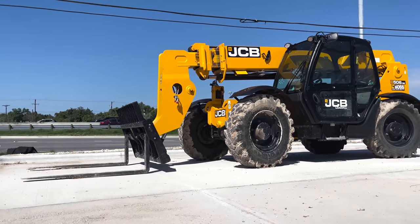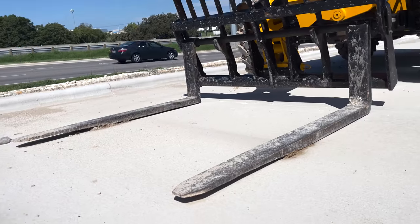Next I grabbed a telehandler — people just call it a forklift. I used a 5,000-pound rated strap wrapped around the assembled poles, slid my fork through the strap, lifted them high up in the air, and carried them over to set them down. I went a few inches above the pole base before actually setting it down because I had two guys on the ground making sure the bolt pattern was going to match. They had to take the ground wire put down in the base during pouring and make sure it gets stuffed up so that when the pole slides down, the ground wire is able to stick out of the little hand hole that comes on all these poles. Once we barely set it down and confirmed everything would match, we adjusted screws and banged on them a bit more to get the pole to drop down on those anchors. I very slowly and carefully — with nobody's fingers in the way — lowered the pole down and got it to set on the bottom set of nuts.